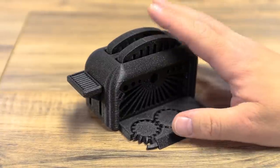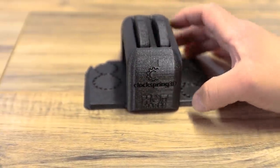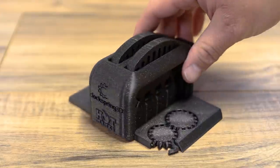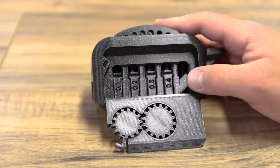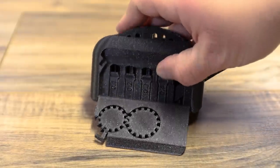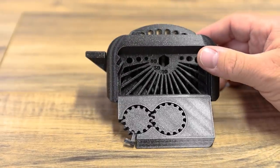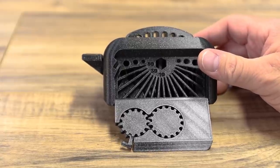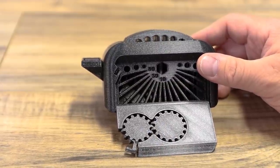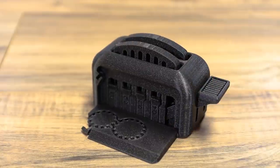The second print I went to was the brand new Hot Makes ClockSpring 3D Torture Toaster, printed in Prusa Galaxy Black. The ClockSpring 3D Hot Makes logos came out absolutely awesome. If we spin this around, you can see inside — the 0.05 peg actually fell out and I lost it, but the moving parts do move, which is very awesome. The printer did a great job with just the default profile from PrusaSlicer. You can see the overhangs and the cooling — those dual fans really help with your overhangs. The cooling is awesome for prints like this on a torture test. And yes, the toast does pop.